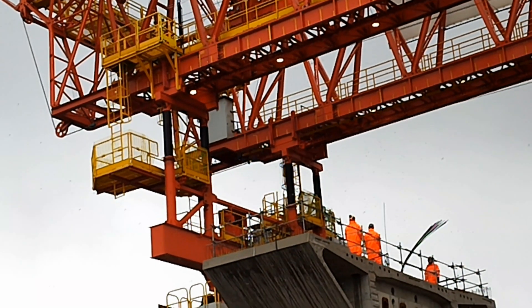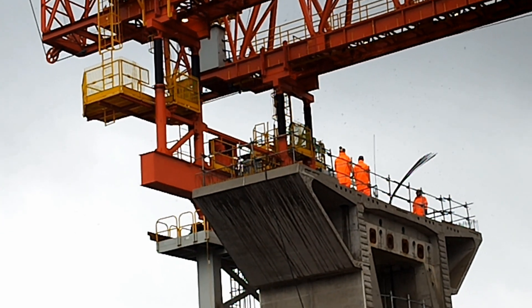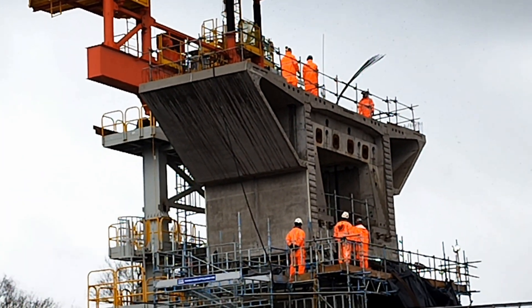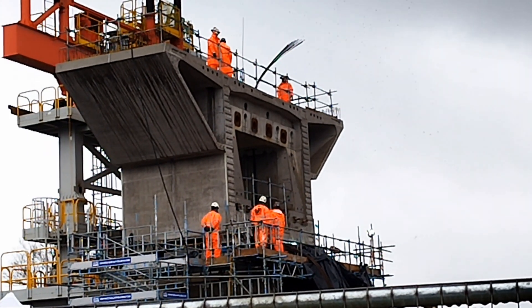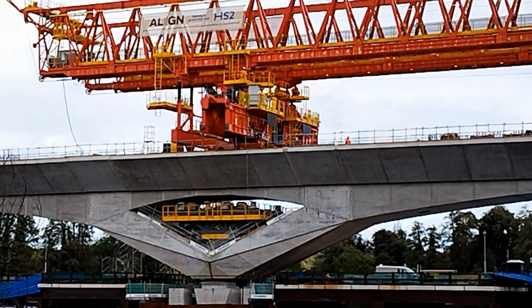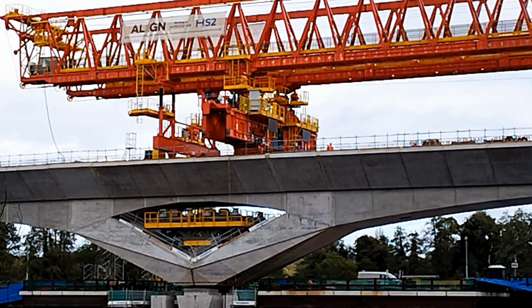Now two of the sections can be placed on top of the pier and post-tensioned down. You can see the wires sticking up here, and then the main front leg can be moved forward to the pier and fixed down, as the blue lines show here. So now to move the rear leg forward — here we see the small rear leg fixed and the main rear leg being moved forward to where the front main leg was.